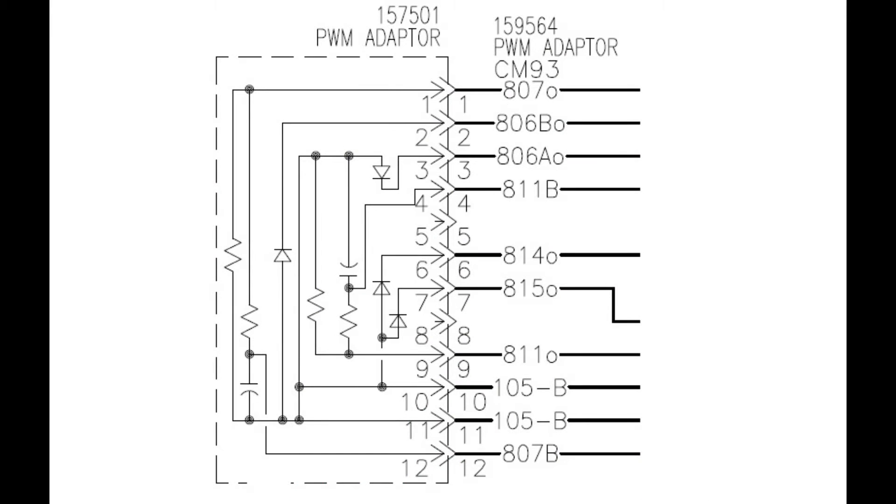So as we have just shown, the PWM adapter plays an integral role in voltage conversion. With the PWM adapter not present in the system, the Danfoss valve will ignore all voltage signals incoming, with the exception of grabber. This is because the grabber circuit is non-proportional.